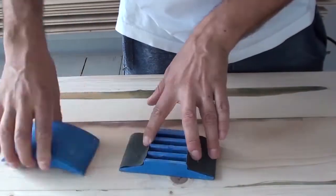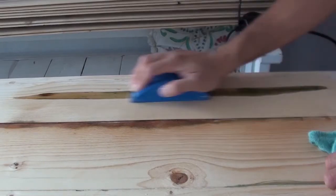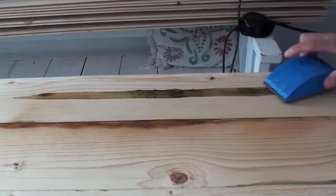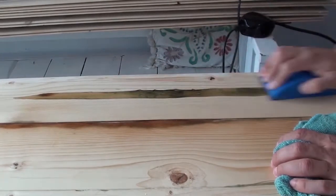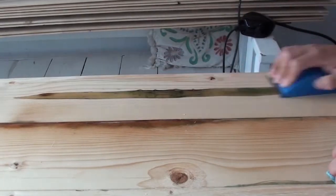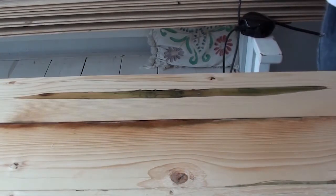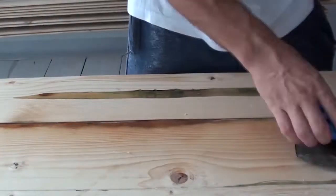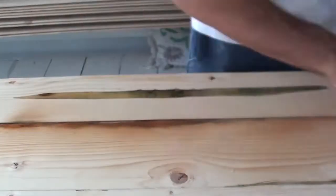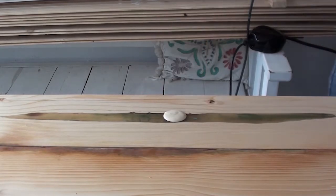From a grain size of 300, it is recommended to do the sanding with water. Wet sanding with waterproof sandpaper is often the best approach to sanding hardened epoxy. Wet sanding removes blobs while sanding, reduces clogging of the sandpaper, and drastically reduces the dust expelled into the air. Sandpaper lasts significantly longer and you can immediately see the sanding result. Finally, you can finish all the steps with a polishing paste.